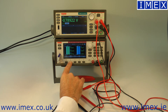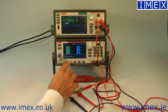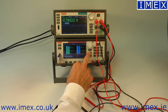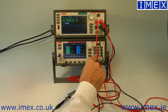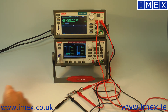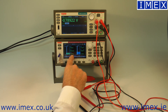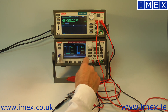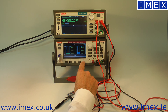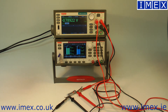We can change the simulation mode to dynamic or static. In dynamic mode it will behave like a real battery — as we draw current it will discharge. Or we can go to static and set the state of charge manually. If we set state of charge to 20% remaining, our open circuit voltage is 1.1 volts and our ESR is 0.268 ohms — just mimicking what was measured from the AAA battery. If we adjust the charge back up to say 80%, you can see the ESR is reduced and the open circuit voltage has increased, copying what the battery would do.